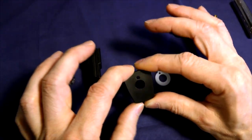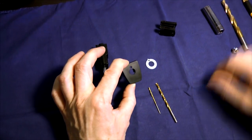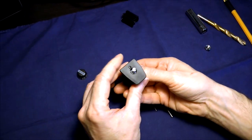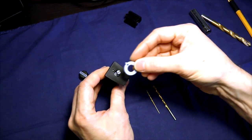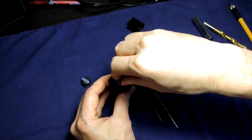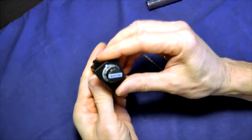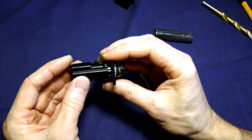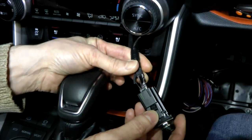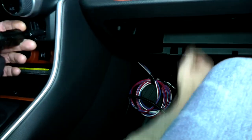To modify this part you have to use a pilot drill bit, a 3.5mm drill bit, and a 10mm drill bit. Then install this nut and bezel — the bezel goes first, and then the nut. Both clips should not be interfering with the old design of this switch, which goes here and there.